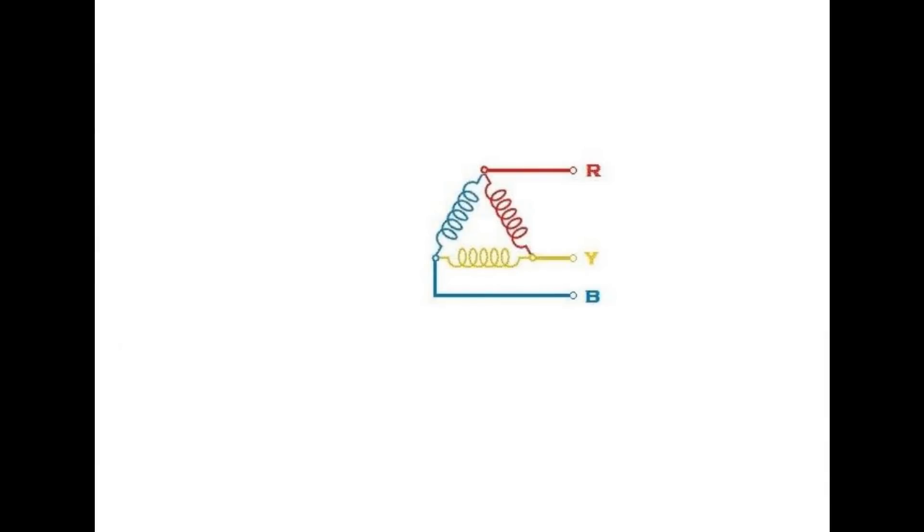Those three coils are joined at a center point. When you look at your brushless DC motor, you'll either see three or four spots of solder where the wires to the coils go. If there are four spots, that's a Y-configured brushless DC motor. There is another configuration that's like a triangle — the Greek letter delta — so that's the delta configuration. It has only three junctions. If your brushless motor has only three spots of solder, it's likely to be delta. If it's got four spots, it's Y-configured. Identify the spot with lots of wires, ignore it, and then proceed exactly the same way.